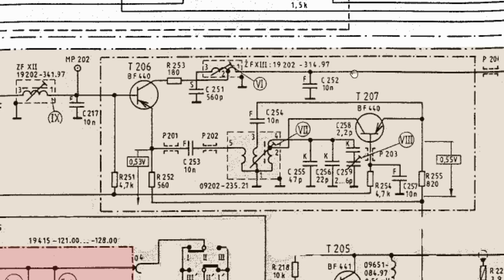And because from here forward, it's optimized for 460 kilohertz, if this sees 460 kilohertz, that's what you'll see coming through. If this is 2.48, that thing there won't be 460. So it'll be reduced, it'll be attenuated, because it's sort of on the edge of the curve that we wanted to produce. So it'll be lower. Therefore, when you adjust this to exactly 2.46, because that one is 2, you get 0.46